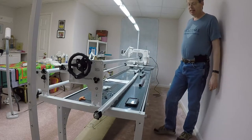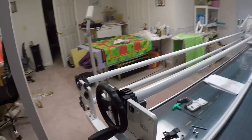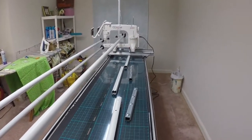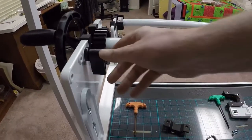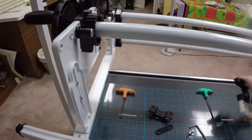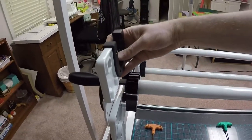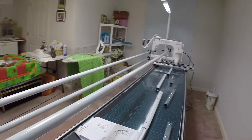So we have to do a little bit of disassembly. I'm going to show you exactly what's going to happen. First thing we're going to do — here we've got the take-up rail with the crank on it — is remove the take-up rail from the machine. I've got the machine slid down to the other end. I'm also going to remove the ratchet off of this area here, off of the frame. Once I do that, I've got two pieces, one for each side, that I'm going to install.